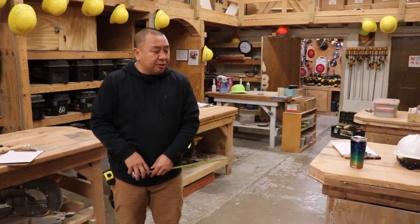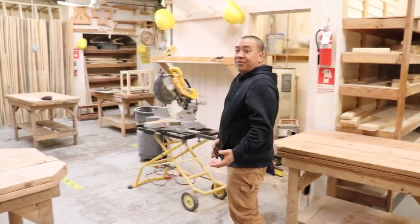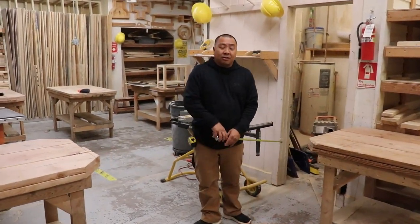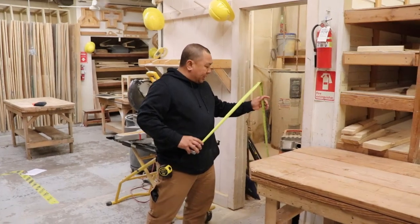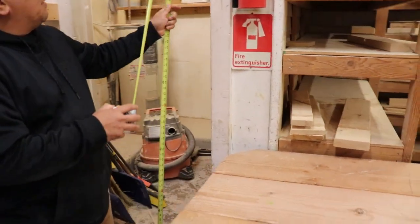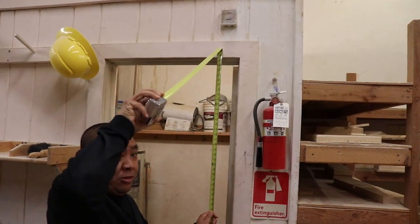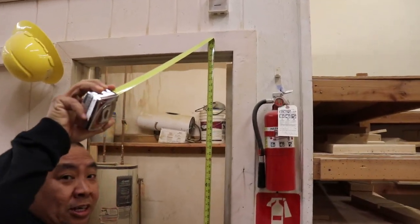As a carpenter, you use a tape measure all the time. Practice every day — it clips onto your belt, it stays with you and you just start learning to measure stuff. If you already have good tape measure skills, then work on adding fractions until adding fractions becomes normal. But if you're still struggling to know which is the eighths mark and which is the sixteenths mark, then daily practice until that becomes second nature.